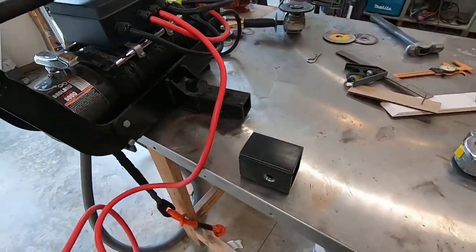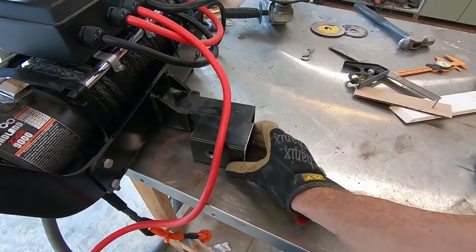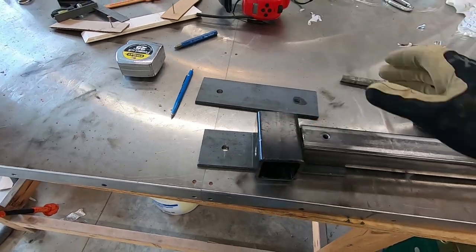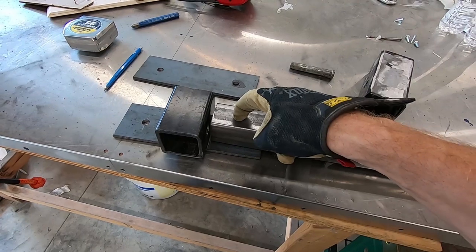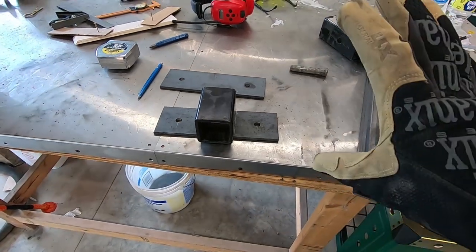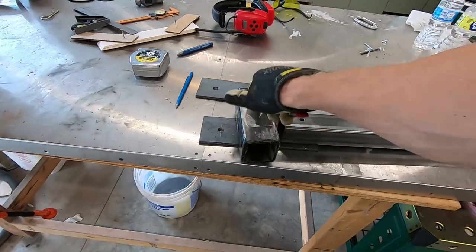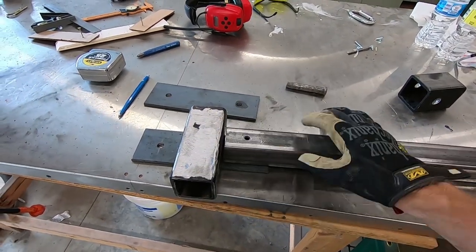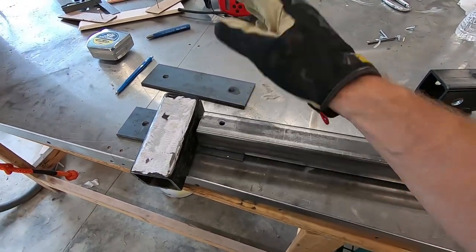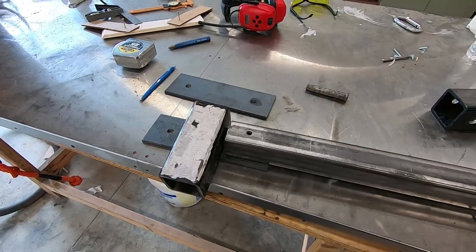Slight miscalculation here. I got this receiver tube cut just perfect so it can be as short as possible, but what I didn't account for was when this gets welded to the plate, I'm not going to have room to insert my pins with the swing arms on. I want to be able to attach this to the tree and then put the winch on last, so that's not going to work. I've got another chunk of tubing I just cut off, and this is what I'm going to use now. It'll stick out a little further, but now I can get the whole assembly attached to the tree and then come in and have room to insert the pin and attach the winch. Little change of plans, but no problem.